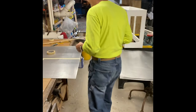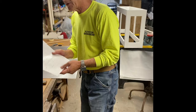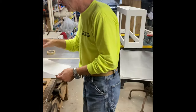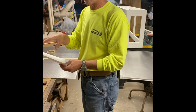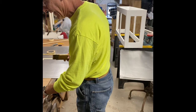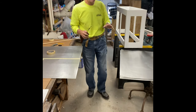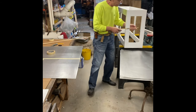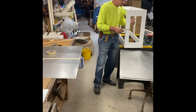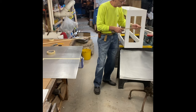As I get ready to cut these screens, I go back to my cut sheet diagram on all materials. I've laid out all the screen cuts to maximize all the pieces out of the screen itself and minimize waste. I've got my measurements here — eight and a half by eighteen and a quarter for the side panels. Now I'm going to verify at the actual piece: the inside spacing is seven inches, and I want to add three-quarters of an inch overlap on either side, which gives me eight and a half.